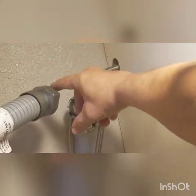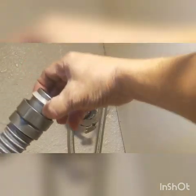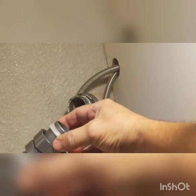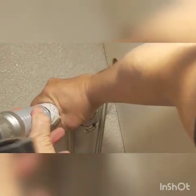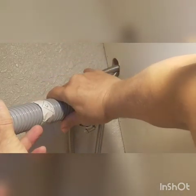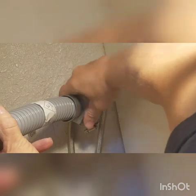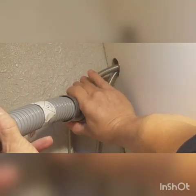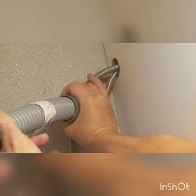In most cases all you need is your lock nut. Take your seal and push it up here, bring it to the edge, then push this in place — good and snug. Then screw on your locking nut. Now what makes this nice — I'm not going to use that bushing adapter to the wall drain.